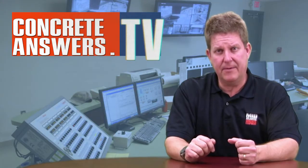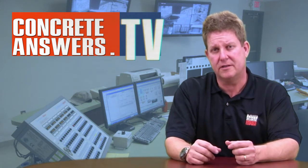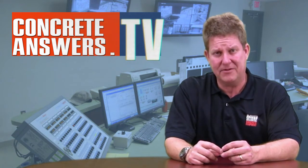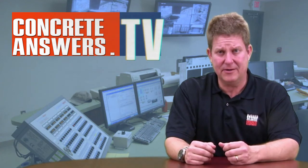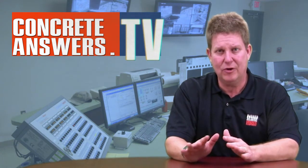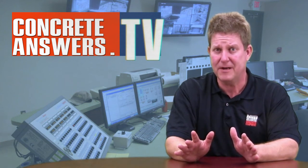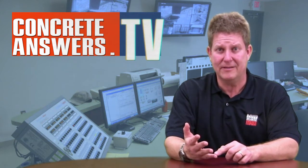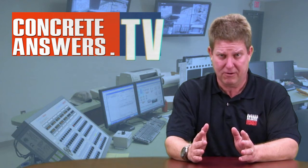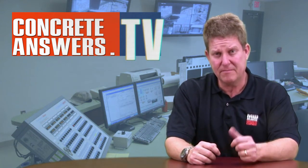Thanks for the demo. Looks like Command's kind of stepping it up here with this PWS, Precision Water Systems module, that they're adding into their repertoire. So if you guys get it, you can empty out a material, dump in a new one, completely different — you don't have to recalibrate for moisture levels. Pretty cool stuff, if you ask me. Makes it easy, simple, fast. Last thing I want as a batch operator is to have to worry about calibrating a probe if I'm switching materials out in a bin. Thumbs up here, dudes.